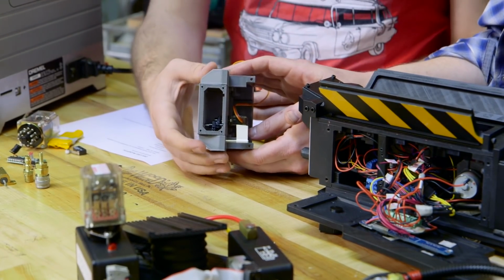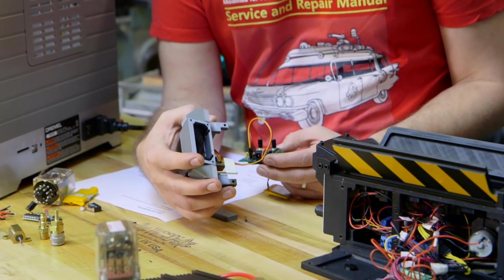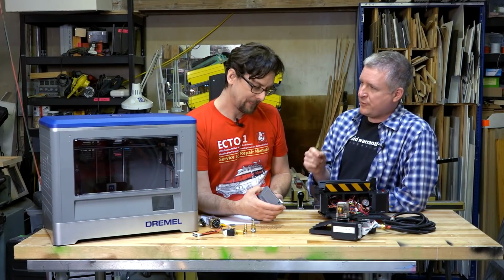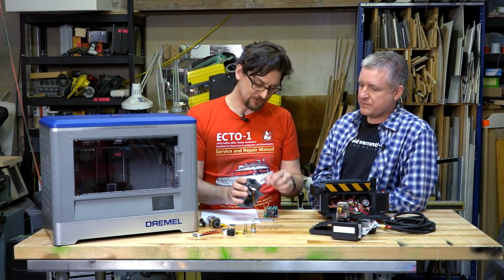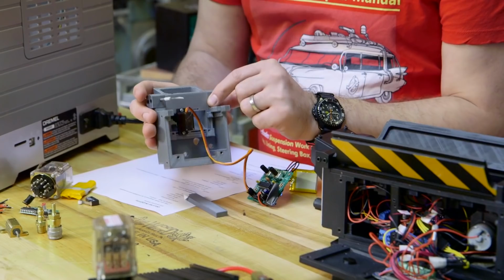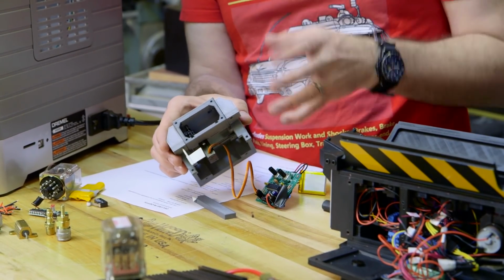That's really cool. So I was very proud of this. This turned out to work really, really well, and once I got the set screws in there, it worked fabulously. And there's one servo for each door? There's one servo for each door, so this is just one half. There are little slots molded into the plastic for the axles to be held into, and they're basically just loose in there, and the chains themselves actually hold them in position once everything's in place.